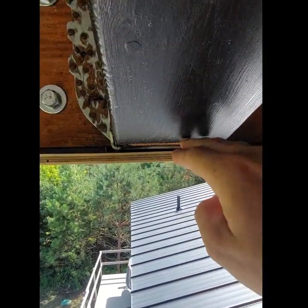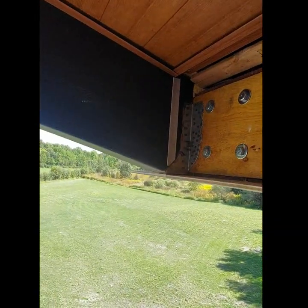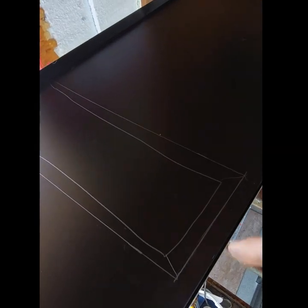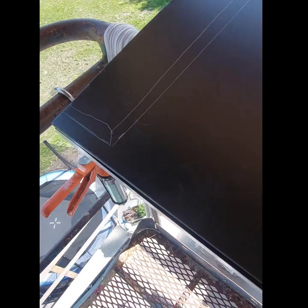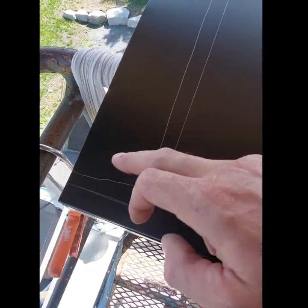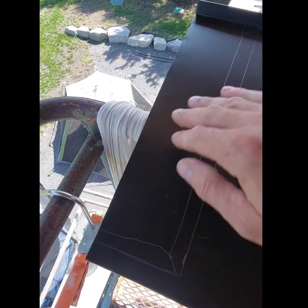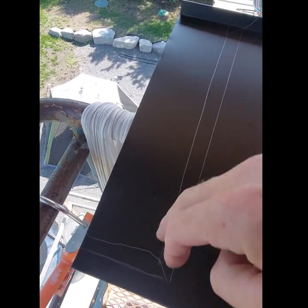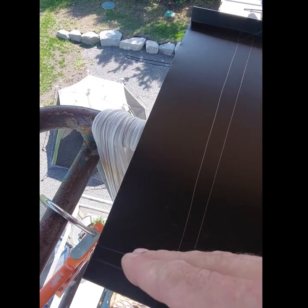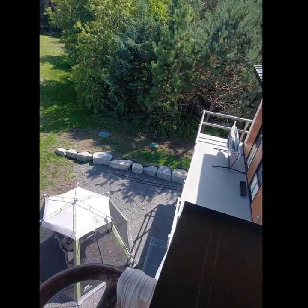Here there's no room for a tab to go in because it's sitting tight against the flange, so what I'll be doing is folding it 180 degrees. I marked out all my measurements. This is my finish line and this is my tab line — three-quarter inch — and this one's going to bend in on a 90 degree because we don't have room to fit into the space on the bottom. I'll fold that one tight to give me a straight edge.